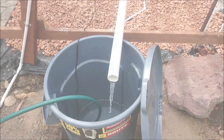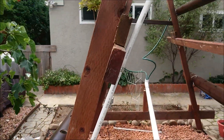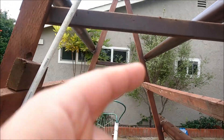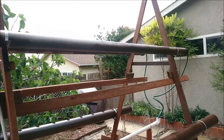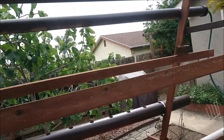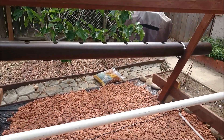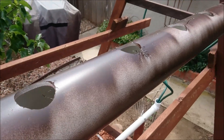For the final phase, we installed our water pump into the tank, put a rubber hose on the fitting included with the pump, and ran it into our half-inch PVC supply system with individual valving. At the end caps we put rubber hoses going into a 2-inch PVC tube — 10 feet long — where water drains from the main PVC tubes, travels down the 2-inch supply tube, and flows back into the tank to be picked up by the pump again. It's really important to make sure your pH, water level, and fertilizer levels are correct and monitored daily to ensure a successful farm. And there you have it — that's our farm and the procedure we used. Thank you so much for watching.